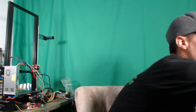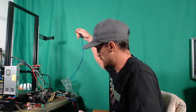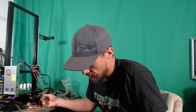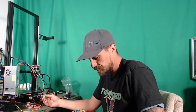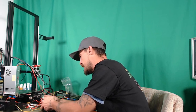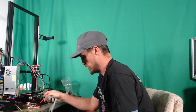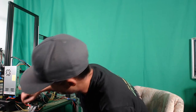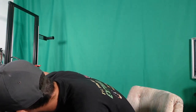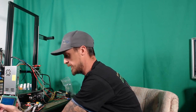Now, the problem comes when I hook up to the power supply. Let's take the USB cable out. I do have this wired correctly, and right now I am only using the main board power supply. I have tried this also with the bed power supply hooked up — it doesn't matter. It just does not turn on. So here is the power hooked up, everything is plugged in. You can tell from my little light here that I am getting power to the power supply. You can see the green LED just lit up, but nothing here.